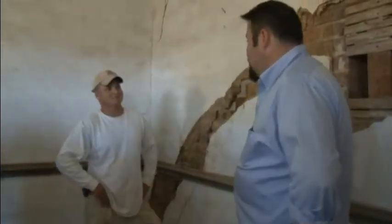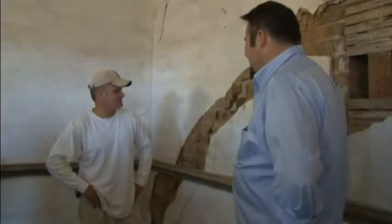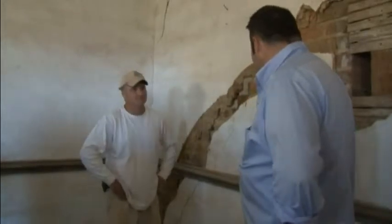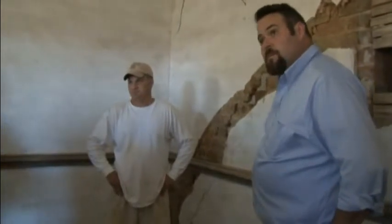The dam works. This material — you're not actually using it as a pointing material? No. This is for if you've got separation of wythes of brick, or a hole back there that you've got to fill up. It's to restore the structural integrity of the wall. Precisely — and then you go back to your standard mortar for pointing. The grout is structural; the mortar is cosmetic. It's helping tie everything together.